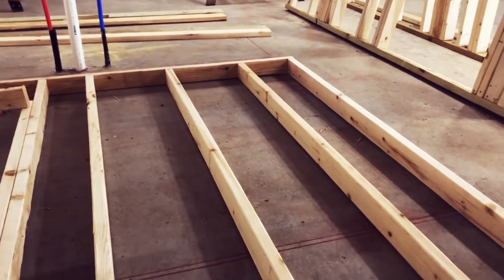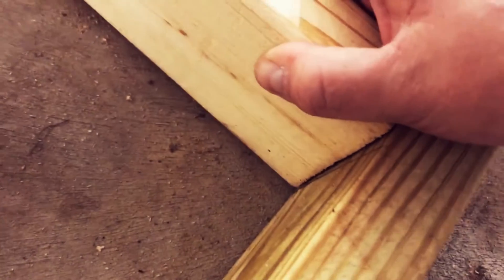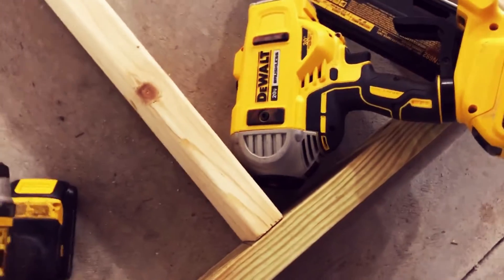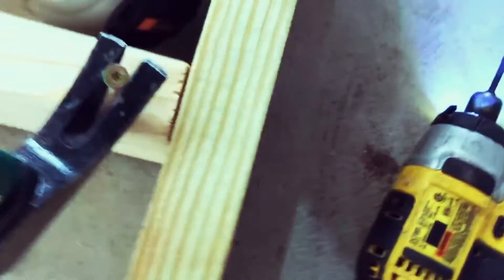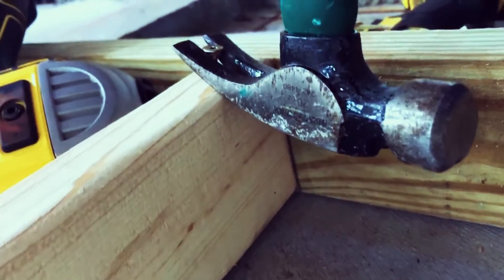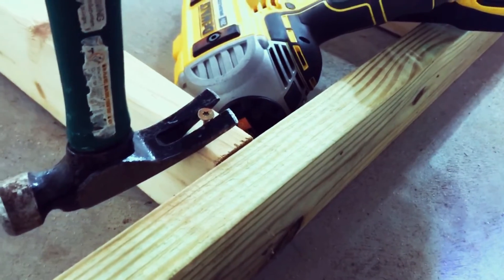Here's the problem with framing up walls — I've got 2x4 studs with a little bit of twist in them, which is pretty normal unless you get unicorn lumber. What you want to do is get it lined up at the bottom and fire a nail right down here. Then the trick is just grab a regular screw and put that in — just go about that far — and then you can take your hammer, grab it like this, and untwist it. You can't do just two hands while I'm holding the camera, but just go ahead and fire a nail in there and it'll stay straight.